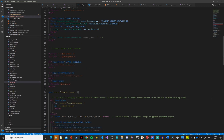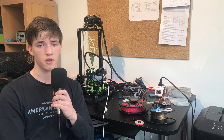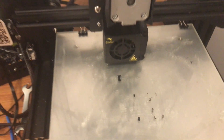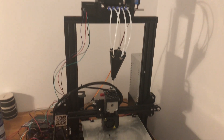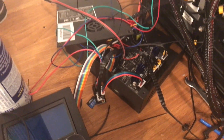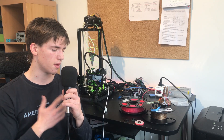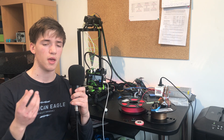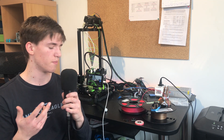With the primary testing I've done it seems like a really good option. On the direct drive setup side, things have come along quite a long way — all the software has been coded and is working properly. I just need to do a bit of work on the physical side, mainly with the adapter that connects the direct drive extruder, which has no PTFE coupler, to a PTFE tube that then connects to the material switching unit. This is the main challenge, because having an extra extruder between the MSU and the nozzle adds one extra failure point and a fair bit of added complexity to achieve reliable printing.